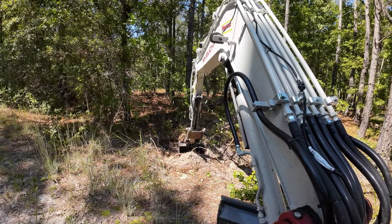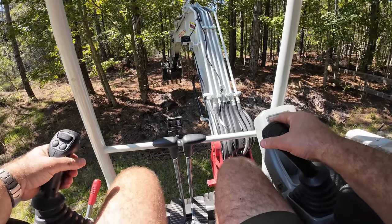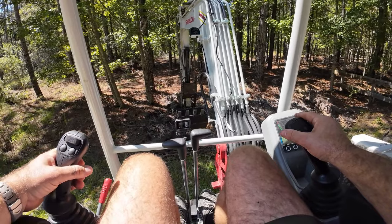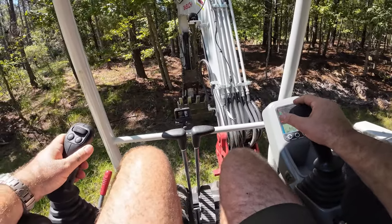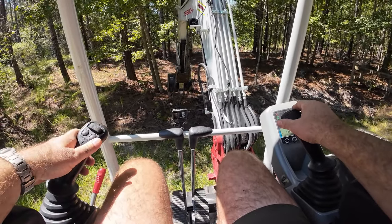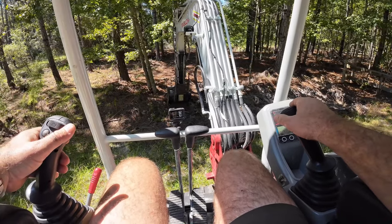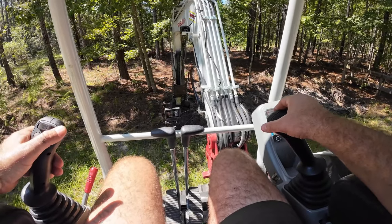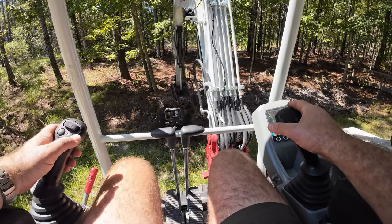I moved up to the entrance of the property, and what I'm working on is digging the ditches that used to be a little bit deeper, cleaning them out. The sand has kind of drifted down into the ditches, and during the rainy season it'll rain hard, and that whole area actually floods with 3 to 6 inches of water. So what I'm trying to do is create a place where the water can go and pool versus staying on the road, where you drive on the wet road and it creates ruts and problems in your road. So I want to help that water get off and also do some shaping of some ditches that lead up to this particular low area where my entrance is, and hopefully avoid water even getting to that area faster than it can drain and soak into the ground.